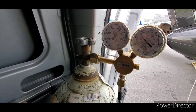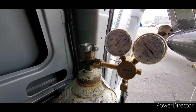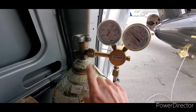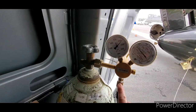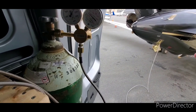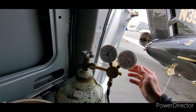We don't want to ram too much pressure at once into an oxygen bottle when we're filling it, or you can actually cause it to overheat and explode. This right here is getting incredibly cold because of the high pressure inside the bottle — at this valve it's expanding to a lower pressure, which is what's in these hoses that flow over to the aircraft. As it goes into the bottle and is compressed, the bottle becomes hot.